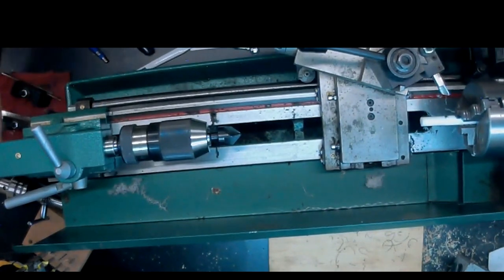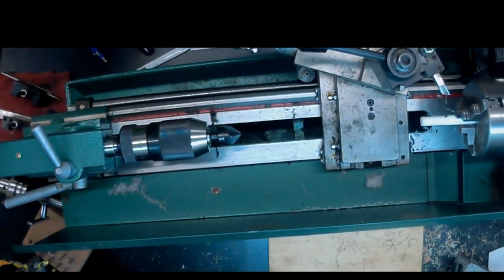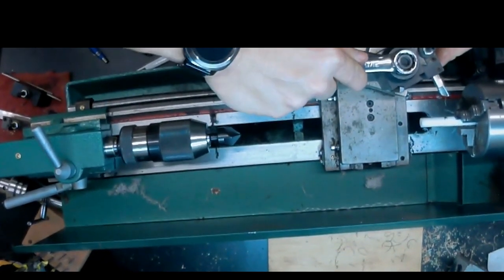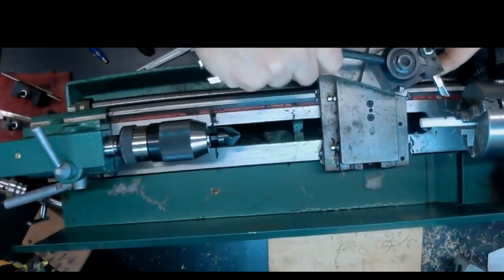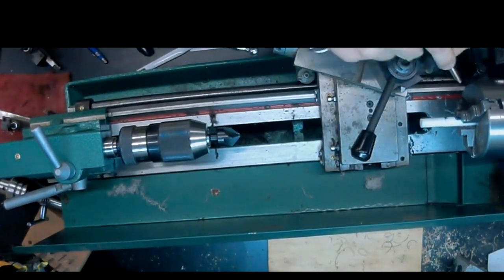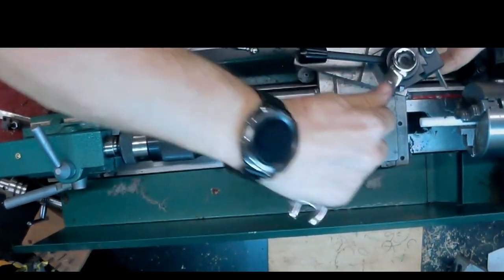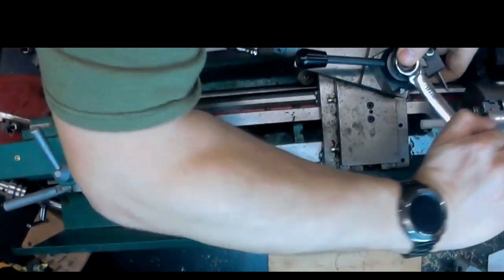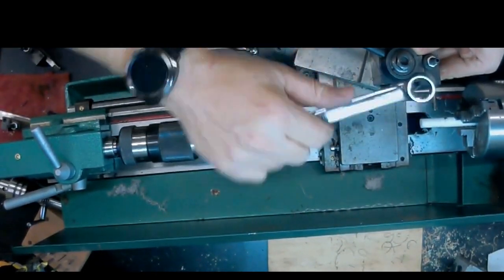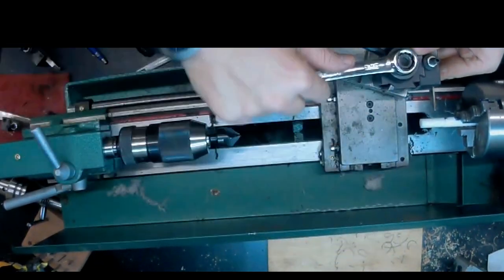And now, because we used a piece of Delrin that was 3/8 of an inch, and that's the diameter that we're going to use when we drill the hole into the stem to accept the insert, we don't actually have to machine the Delrin any further, but I do like to put a couple of sort of notches, serrations into the Delrin to help hold onto the epoxy.